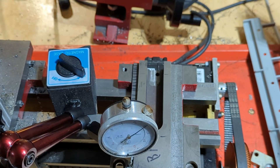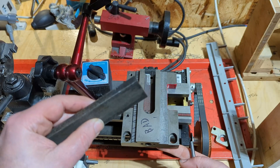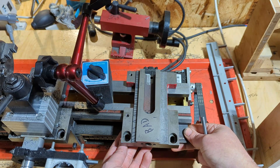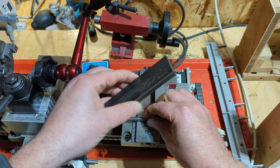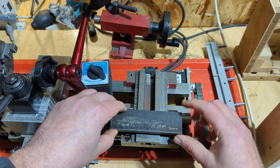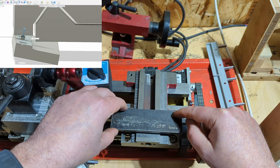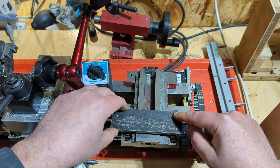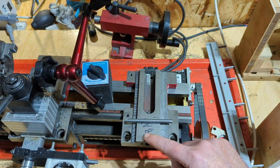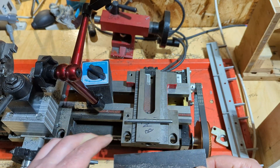What are some of the things that you can do to mitigate this? The first mitigation I would suggest is that the little grub screws — when you get your lathe, you're going to have these little grub screws that are supposed to stand this off of the bottom surface. They basically act like a rolling element, so if I put pressure on this, I basically create a fulcrum, and there's not a whole lot of ways to make this super rigid. It's going to act like a big spring, and if this is springing, you're going to get this rise, and if you get the rise, you're going to have the chatter from your cutter.